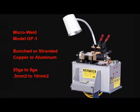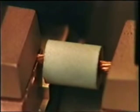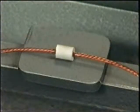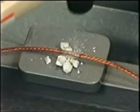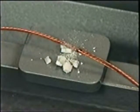The first of this series of welders is called a GP-1. It was designed to weld stranded or bunched conductors from 20 gauge through 8 gauge copper. In this process, the ends of the conductor being welded are placed inside a ceramic sleeve while current is passed through the conductor. When the ends of the conductor become molten, the molten metal fills in the voids between the strands, while the ceramic sleeve confines the molten material to the size of the parent conductor, thereby minimizing excessive flashing or burr.